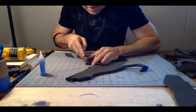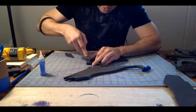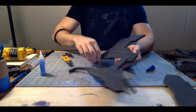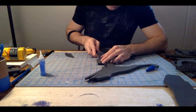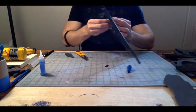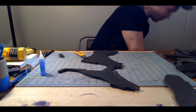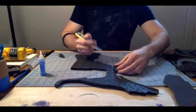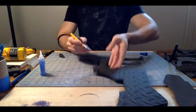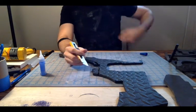Cut from this side. Cut into the piece. Again, 45-degree angle. Back and in. Reason I want to cut top down is because I'm going to be folding this piece to the back. So pull this little channel piece out there. Have a 45-degree groove there. Do it on both sides of this little channel that we've cut already when we were pre-cutting out the pieces. Pull that out of there. Then down the very center, we're going to go quarter of an inch down the center of this thing here. So. Right where it meets, both sides. Pull that out of there, just like that.